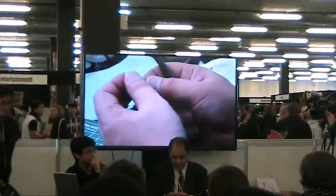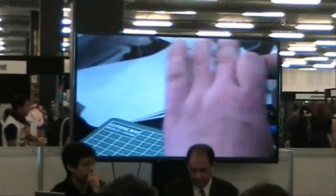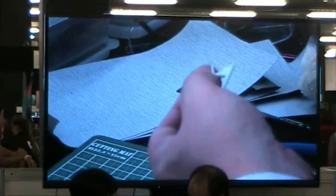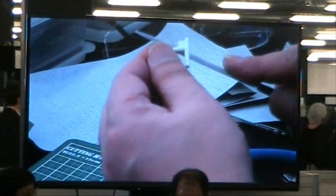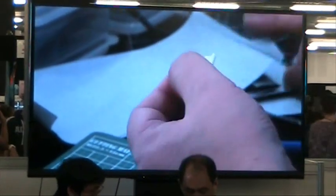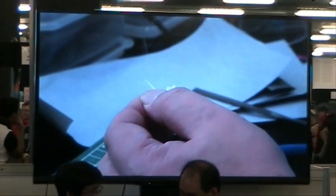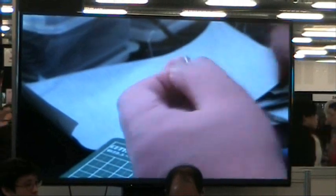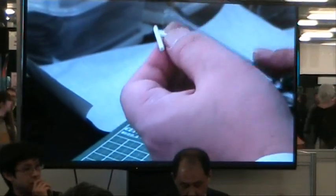But now the front of it is still rounded, so we'll now use the file on the front as well, around all the surfaces in order to make the V-fin sharp. The file use is, well, as demonstrated. Also make sure that you keep your file clean so that it keeps cutting properly. And it's important to make sure that as you file, you keep the angles right so that it is still a triangular sort of shape of the V-fin, as opposed to turning it flat.